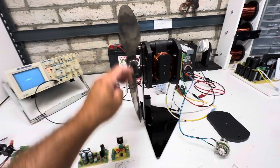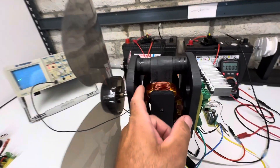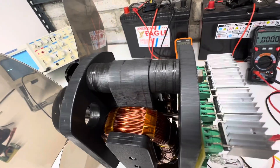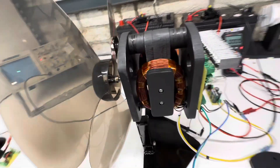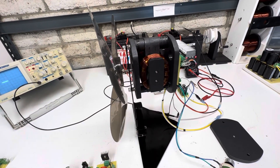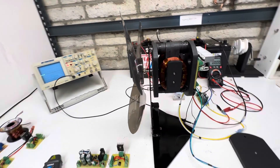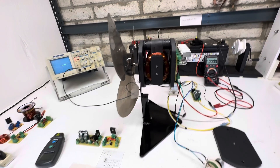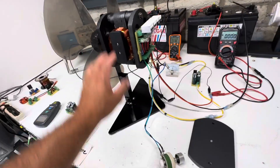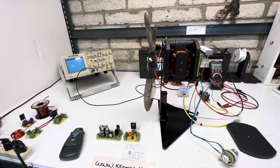This motor should be up on the website sometime next week. It has an inch and a half neo magnet in the middle — you can't really see it, but it's a round one, just one round magnet, so two poles. It has a quarter-inch shaft and I have a conversion to the 5/16ths for the bigger props and stuff, so this conversion comes with it, and the motor will come with the on and off switch. It's a three-inch motor, so let's get it fired up.